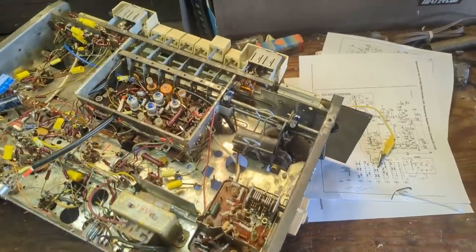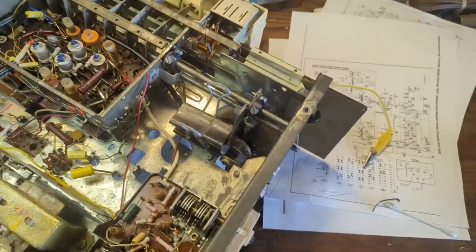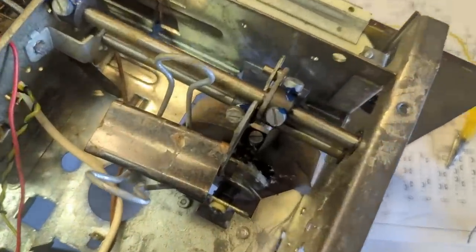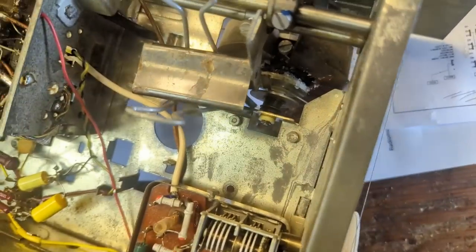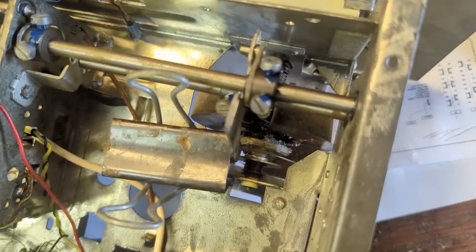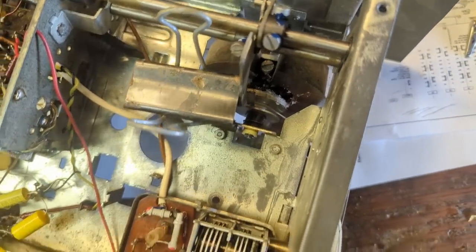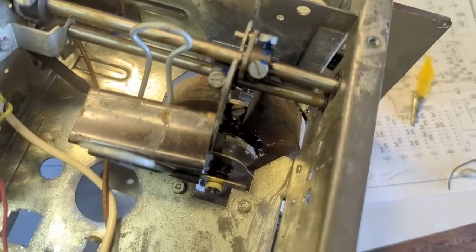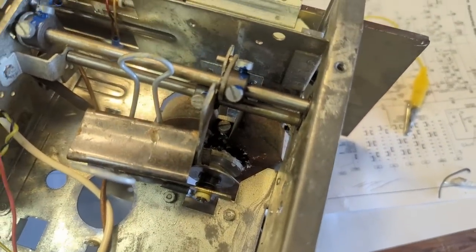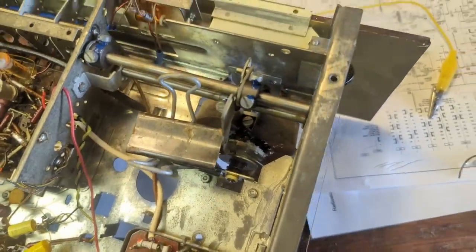Welcome to day 4 of working on the Grundig. And what I did last night before I went in, and it's kind of hard to see this, and it looks sloppy, but that's okay. I put some Lexel glue to put the rubber pad on the clutch surface back together. And I applied a little bit of that to the flywheel here. It just gives it a little more grip. I'm using this clip to hold it away from the surface until it cures.